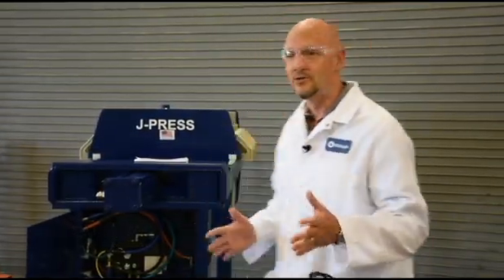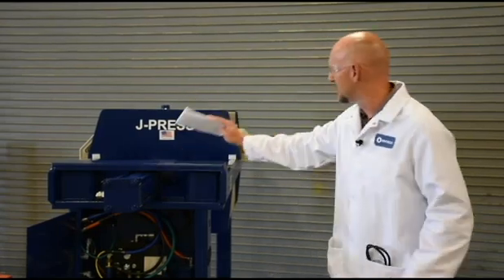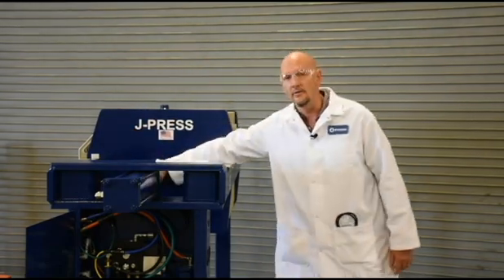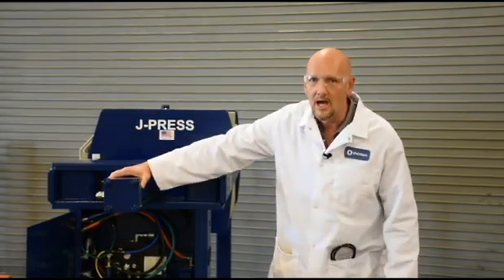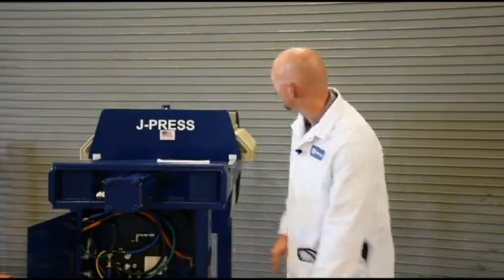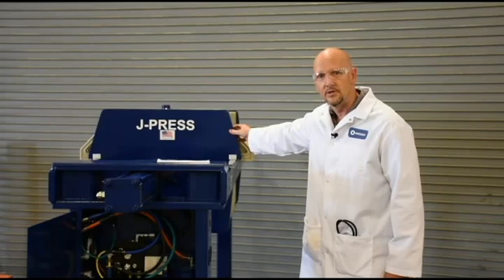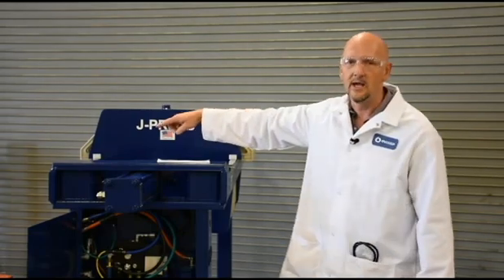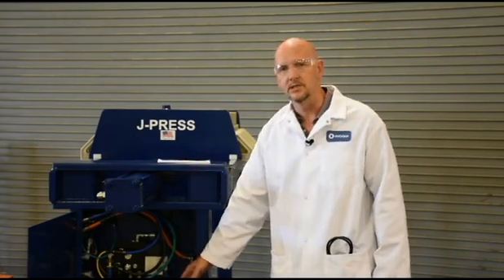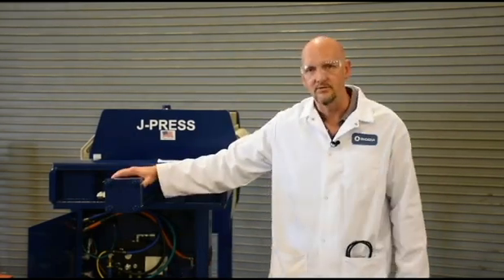So how do I get the oil out of my system? That's another great question — Jeff, you're full of great questions. Since this is an air over oil hydraulic system, you have got air on the rod end of your cylinder and oil on the cap end of your cylinder. To get all the oil back into the reservoir, you want to open this press up. You just do that on your handle when you've got the air hooked up — you retract the cylinder, that'll push all the oil back into the system, so you don't have any oil left in your cylinder.